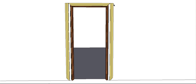Cut out the length, do the same on the other side obviously, and then you can turn them around, glue your mitres using a PVA glue, and of course then you can nail it all off, making sure when you do nail it off that you maintain the gap between the jamb and the door and you don't move it too far by pulling the jamb in and out. So there you go, that's how I do my architrave around a door.